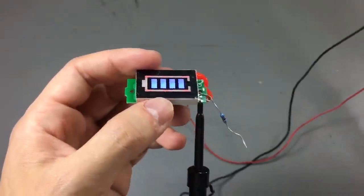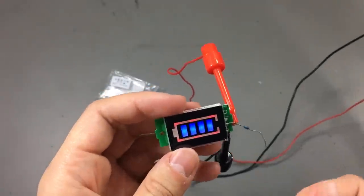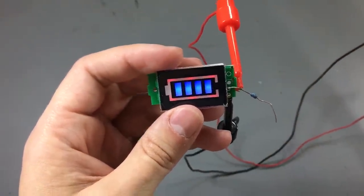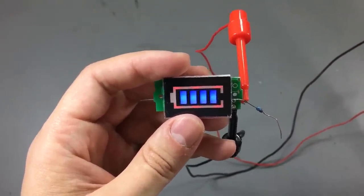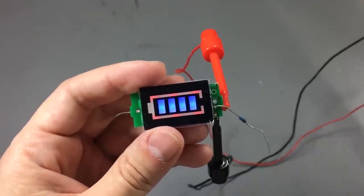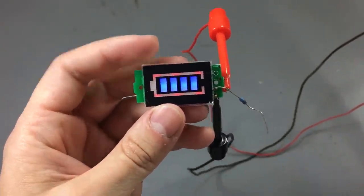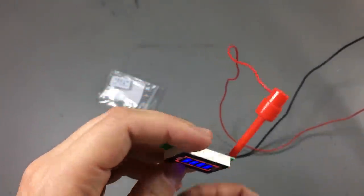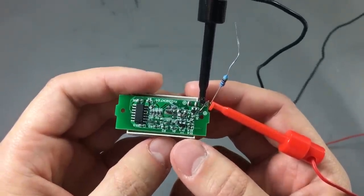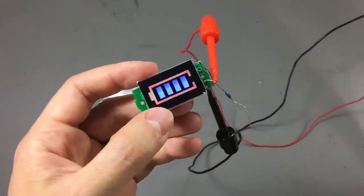I'm not sure there's any way to adjust those levels — maybe in hardware but not in software. I see a switch was provisioned in the PCB layout, and it would have been nice to include a calibration menu using that switch with a long press, going through a calibration sequence where you measure the voltage applied at the input. I don't think they use different firmware for different cell counts, but rather simply change a resistor value in a divider to adjust the ratio. So you might be able to change yours for a different range by adjusting that resistor.